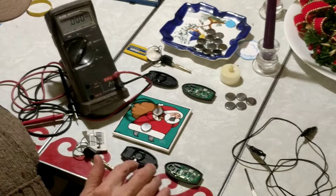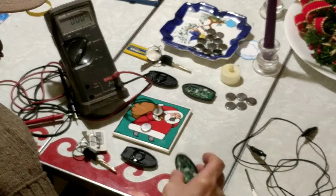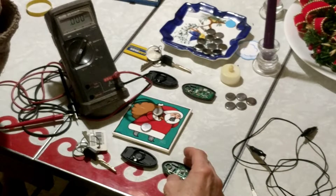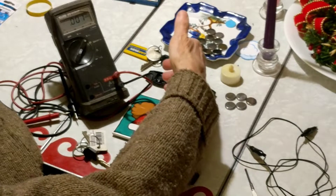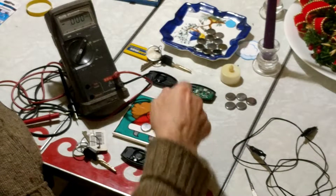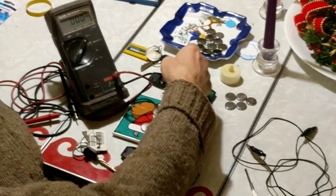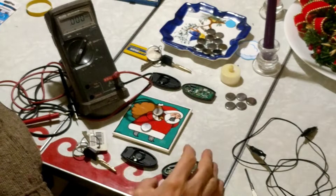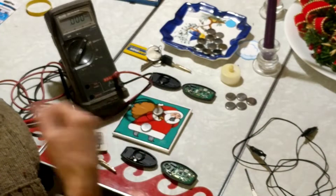I had some time and wanted to get to the bottom of it — I just wanted to know whether or not the car fob was any good. What I did was start swapping components from my wife's fob onto my fob. I took the back of my wife's fob with the dealer battery and it worked fine, and I subsequently traced the issue down to the battery.